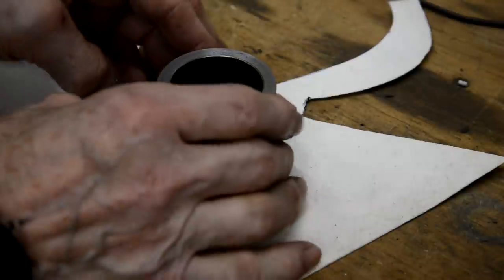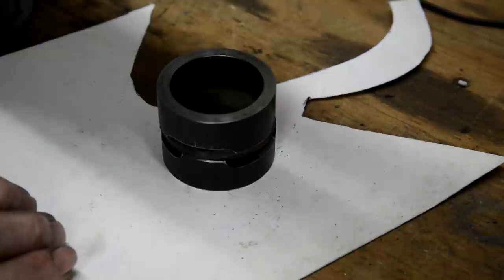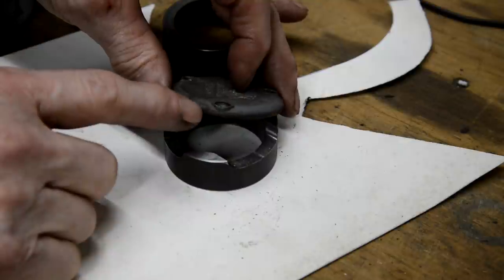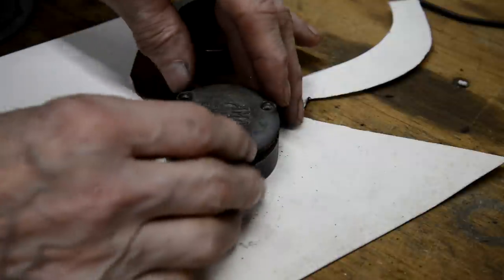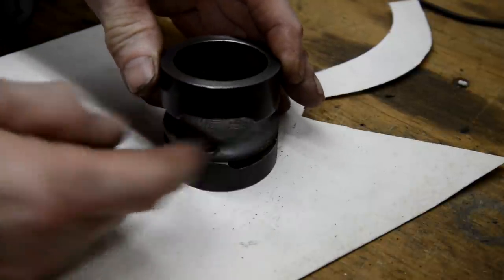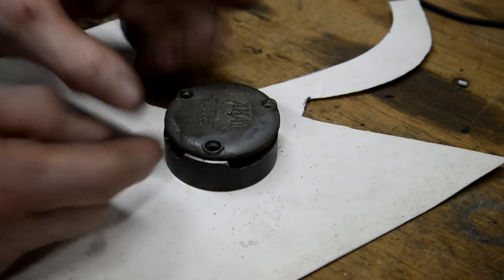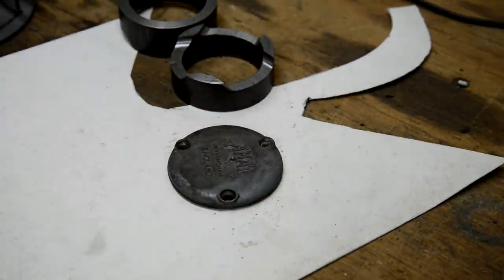And then he mentions doing it in a vise. It's a lot easier if you've got a press, because trying to hold it all together while you put it in the vise is difficult. And then when you press that, you straighten this out. Now, it's not easy to do, I'll admit, having done it, and I don't think I've quite got it right. But what I think you've got to do, rather than just straightening it, which is difficult to gauge, is, because these are so big a cutout, you can actually bend the parts that are high down, so that when you put that on and tighten it down, it'll all flatten. So that's that. Now then, what about these electrics?